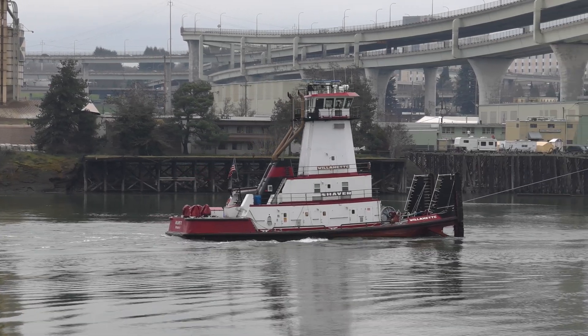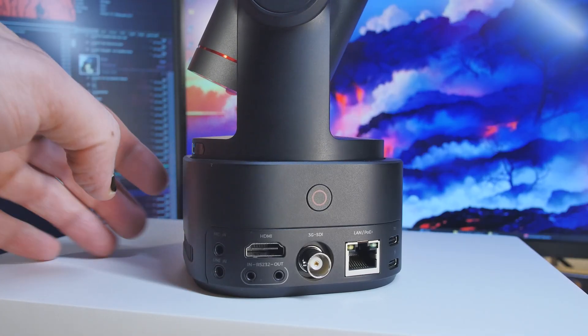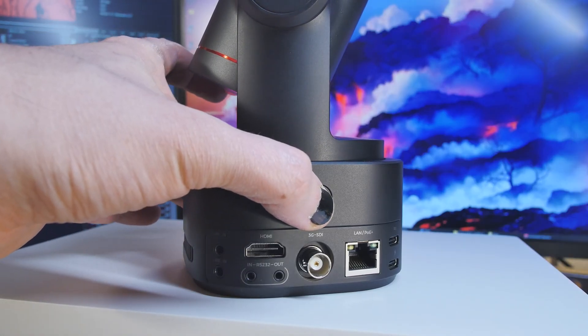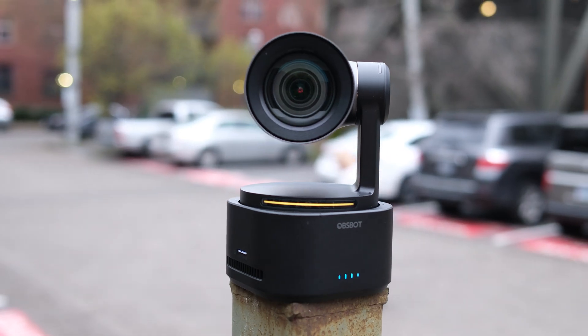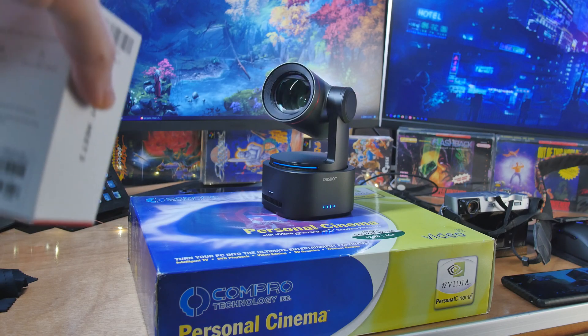Right now I'm in a very dark room. Using this in a studio, you have NDI support, and it's also compatible with NDI HX3, which is the latest greatest when it comes to compression — just faster performance over your ethernet. NDI is a standard that allows you to stream video content over ethernet, which is amazing for studios that want to have a bunch of these hooked up. You can access this specifically by its IP address, and it shows up in your OBSBOT Center under the IP address. It works with different programs like Open Broadcaster or more professional things like the TriCaster. If you have a whole bunch of these on a TriCaster running a theater, concert hall, or a really professional newsroom, you could put a bunch of these up there and switch between them. HX3 is the latest greatest thing for compression, so you get better quality and faster performance.